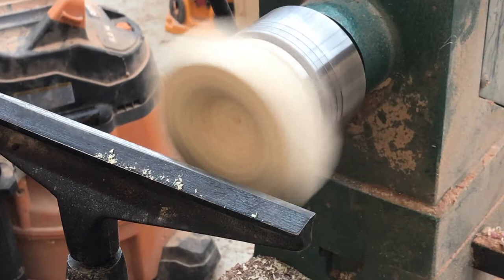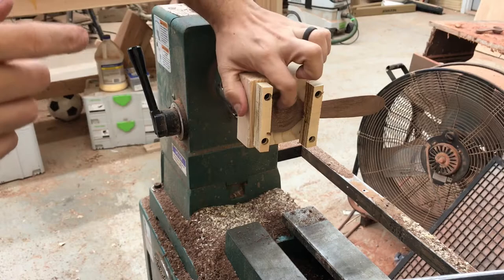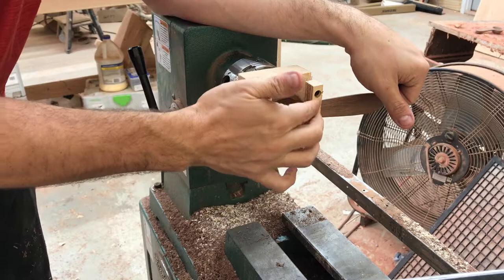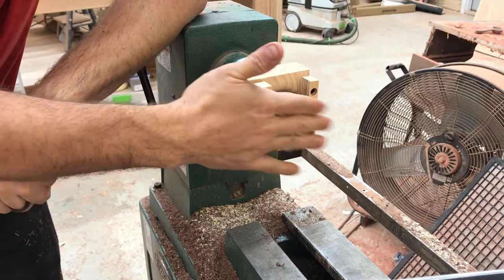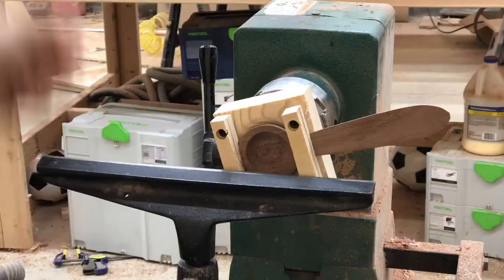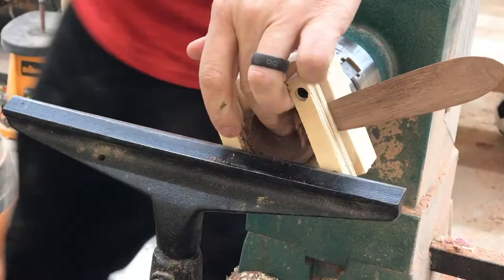I shaped all the way across and flared the outside of the block a bit so it contours with the lip of the spoon. My camera had an issue, so I'll explain: I took two little strips of plywood, countersunk and put some screws in, made sure it's flat, and everything spins good — it's held in there really tight. I chose this method over hot glue because the hot glue was a pain to get off. With screws, I just take them off and it's done.